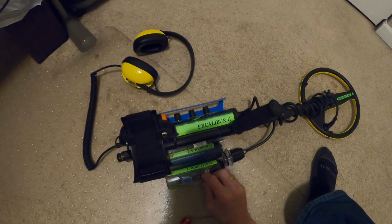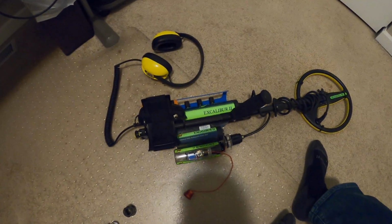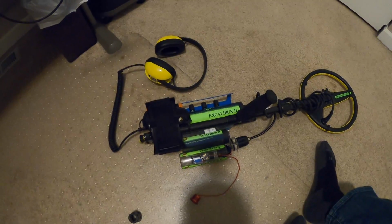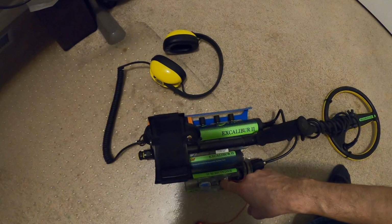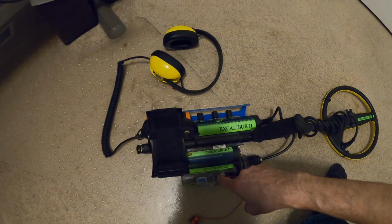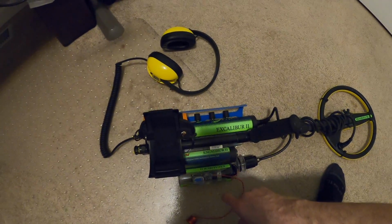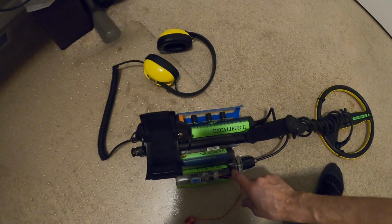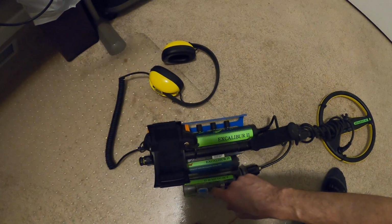One last thing I wanted to mention, this circuit, which is also another critical thing. If you're going to design a circuit to be a push button, like a flip-flop switch for an on-off type of switch for a battery, it's really low current. It's essentially zero. I think it's half a microamp of draw when it's not turned on. Over the course of a few days, I didn't lose any voltage, really, nearly anything at all as far as the battery voltage.